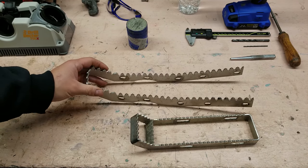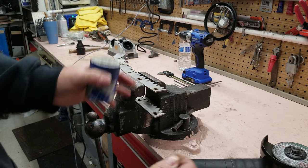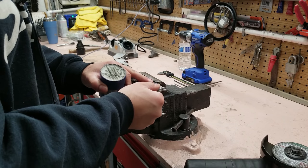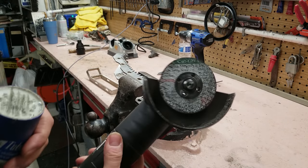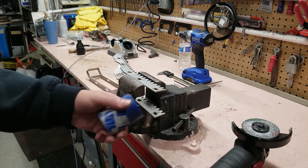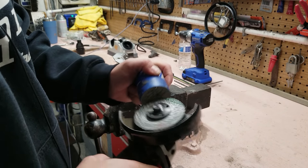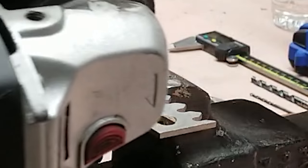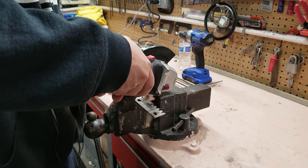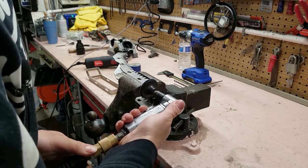This is going to be a major improvement. The first thing I want to do is cut these pegs down - I did decide to take about an inch off. I'm going to use a cut-off wheel, nothing crazy. I'm going to try to keep it cool because this is stainless steel - when you get stainless steel really hot it hardens and becomes a nightmare. So I've got a little bit of cutting wax to help. I'll put a little on the cut-off wheel, make the cut, then clean up the edge with a little sanding disc.